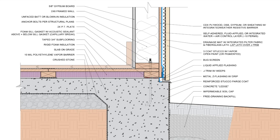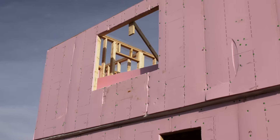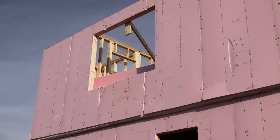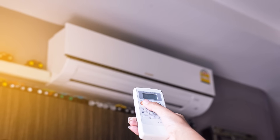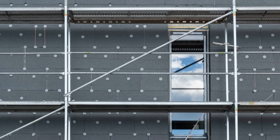If you wanted to take this wall assembly a step further, you can install exterior rigid insulation outboard of the weather-resistive barrier to provide a thermal break between the hot outdoor conditions and the interior conditioned space. You don't need a lot of exterior insulation — all we're doing is trying to reduce the amount of conductive heat flow through the studs so that our air conditioning doesn't have to work so hard. One inch of rigid foam or mineral wool would be sufficient.